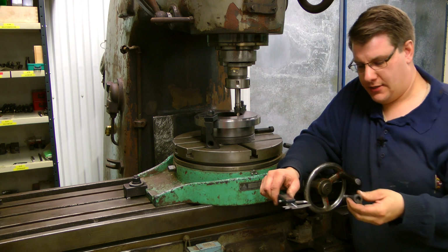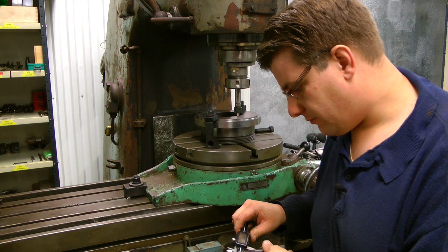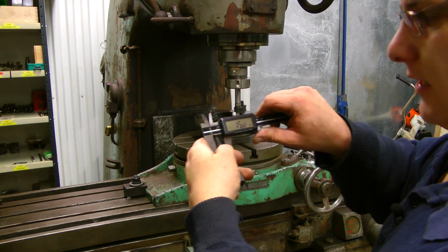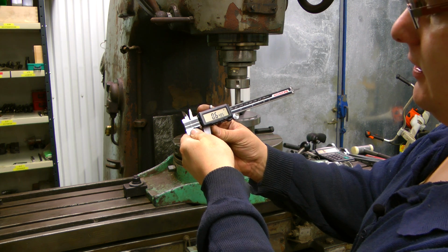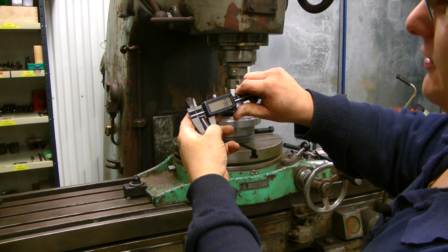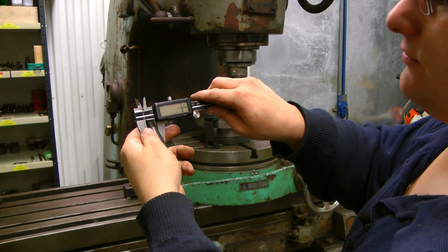And the reason is that these are the bolts that were used on the shock, and I have quite a nice caliper here, and you see it's roughly 15.84. I hope you can see this. And this is from the Canadian AccuSize, and if I change here I can see it in inches, and if I press one more I can see it in fractions, and if I measure here I will see, oh, there it was, it's a 5/8 bolt. And for us guys that are measuring in metrics, this is a neat and handy feature for a caliper.